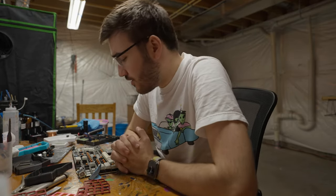The thing is, I'm not certain this is going to work yet because I haven't printed it. My assumption is that it will, but there is a possibility that because infill traditionally allows a little wiggle room for the part to cool and not warp, this could possibly warp by printing it fully solid. But we're just going to have to find out. I'm going to throw these onto an SD card and go down to the basement and get these printing.